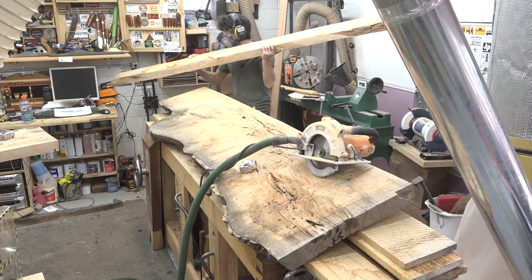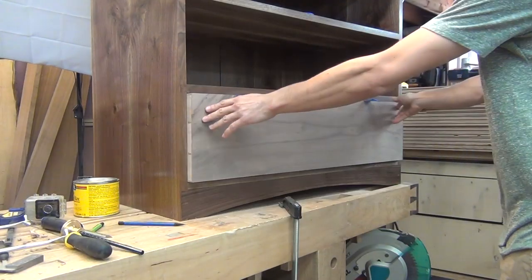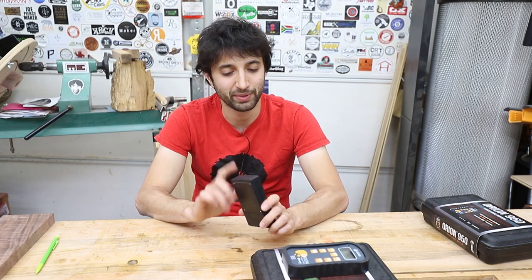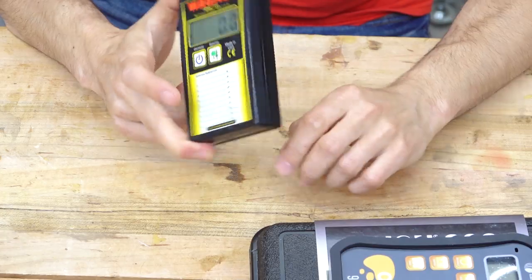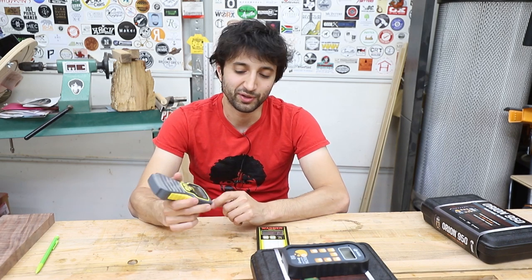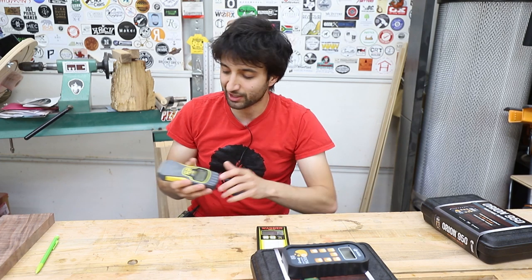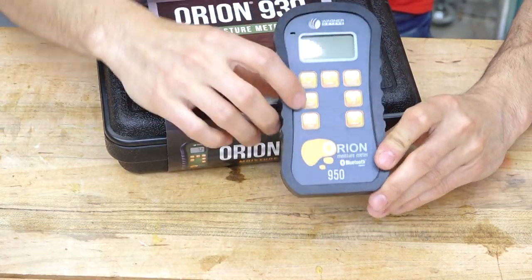For instance, if you're fitting a drawer and setting your gaps, knowing the moisture content in the wood tells you how much that drawer front is going to shrink and either increase or decrease the size of the gaps you set. Now as far as different types of meters, you have your pin meters as well as your pinless or scanning meters. The meter I've been using for a long time is an earlier version of the Wagner meters — these are scanning meters. You place the meter directly onto your piece of wood and it gives you a reading. The other type is a pin meter — it has pins you stab into the wood, which tells you the moisture at the depth you get those pins to. To get to the center of a board you'd have to put those pins that deep or cut the board apart. With the scanning meter, you get an average up to the depth the meter will read.